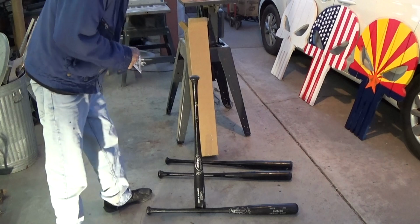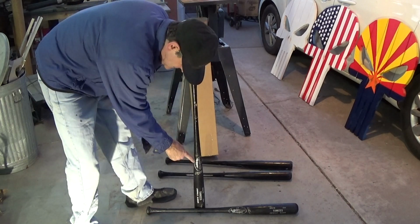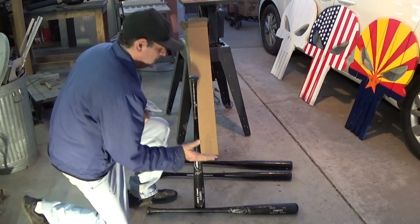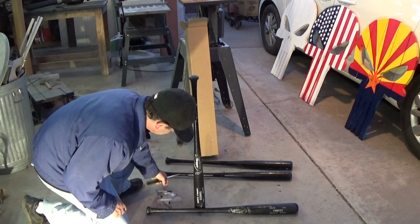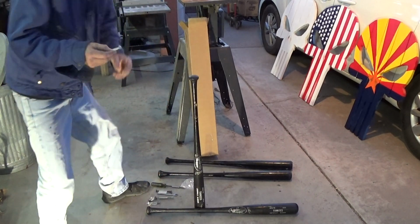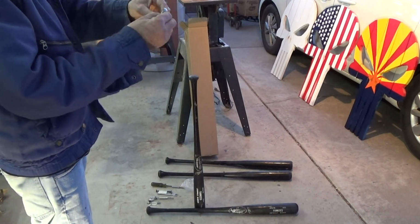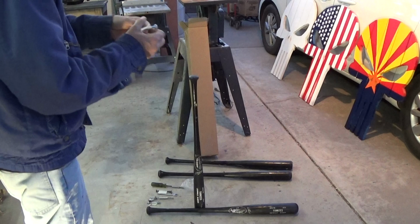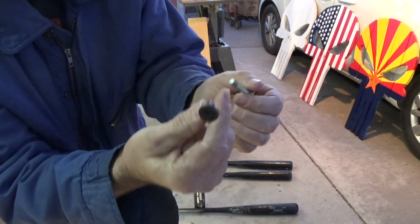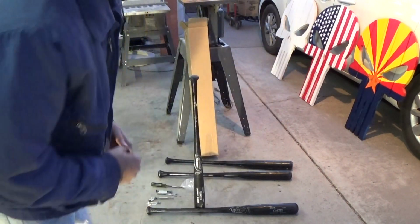It's a strategy. And so what I'm going to do is the first one is R1 is going to stand. I have a strategy of having the labeling of the bat face out to the right side. And we're going to attach R2 to R1. So I go in, I find my bolts. I actually have everything labeled. This is R1 to R2, and you might end up just using basic bolts, and that's about a 2 1/4 inch or maybe a 1 1/4 inch. And because I'm using these futon style connectors, the connector is a little larger than the 1/4 inch diameter of the bolt.